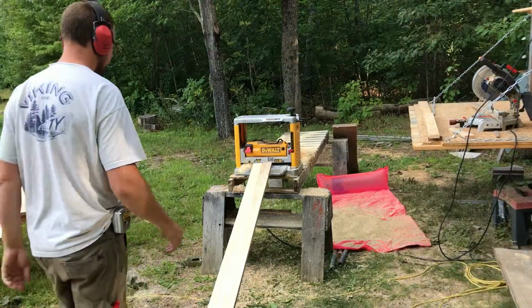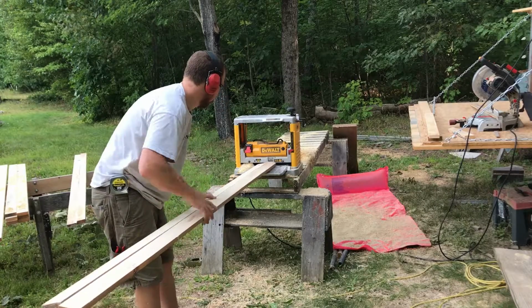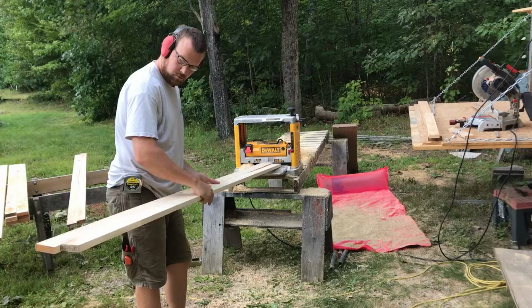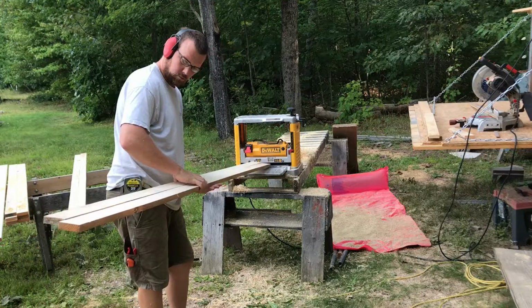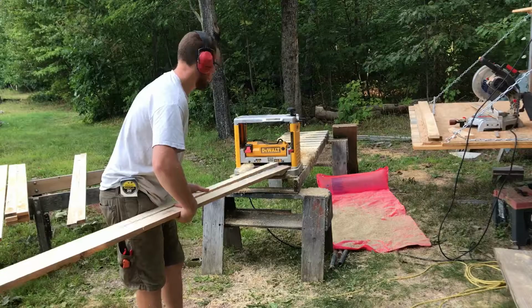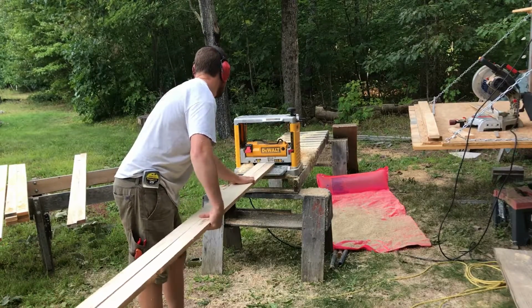When I get down to the last pass, I throw out my flip, plane, place mantra in favor of planing the side that needs the most attention. Take a close look at each board. If there's still any deformity that you think could be removed, even if you just plane that side, go ahead and plane it again. It's much easier and quicker to remove material with a planer than it is to do it with this piece of sandpaper.